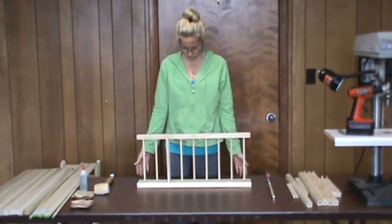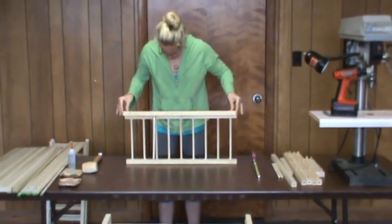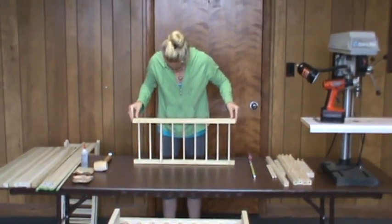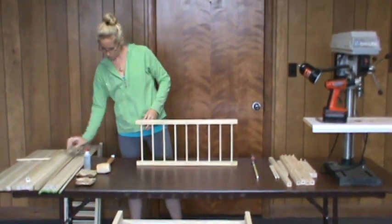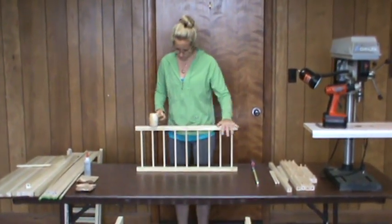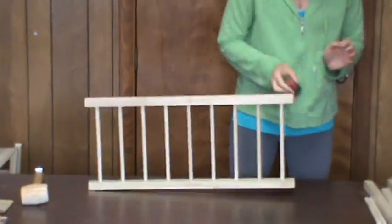When completed, turn the frame piece over and line up the dowels with the holes on the next frame piece. Tap into place, and this completes the shelf. Repeat for all 4 shelves. All shelves should be the same depth, approximately 11¾ inches, before assembling the legs.